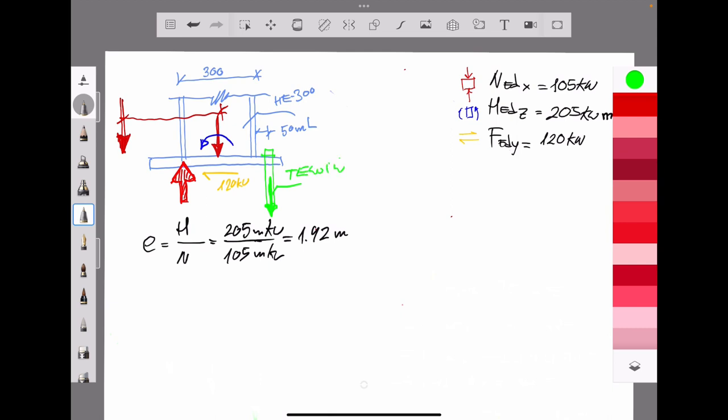It's very important, at the very beginning when we are going to face the design of a base plate, to see what the eccentricity is, in order to verify if the anchor bolts are going to be subjected to important tension axial forces, or otherwise, for example, we are going to have the axial force inside the steel column shape, that for sure is not going to subject the anchor bolt to important stresses.